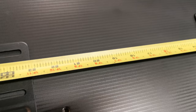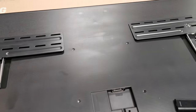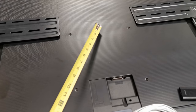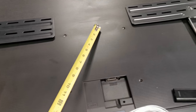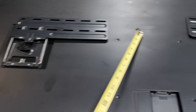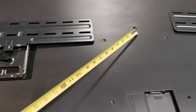Now if we come over here you can see we have 36 inches of play. Why is that something you need to know? Because you need to hit two studs — one here and one here. Chances are if you're trying to mount this in the center of a wall, you'll have a center stud, so you're gonna have to go 16 inches over this way and 16 inches over this way. Just make sure you measure off your center to where the wood is.